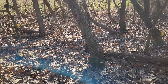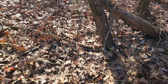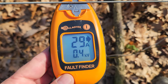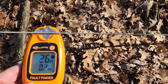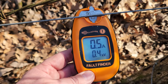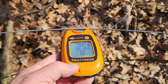I think I might have found the problem here. This old tree fell over onto the fence and pulled the old post over — barbed wire is touching the fence. We'll check it on this side: yeah, we're down to 400 volts and 31 amps. If we go to the other side we should see a drop — yes, that tells us definitely this is part of the issue. Sounds like it's touching in multiple places.